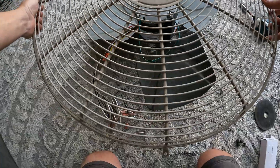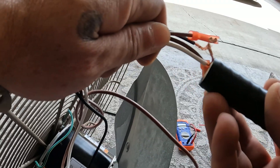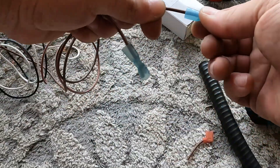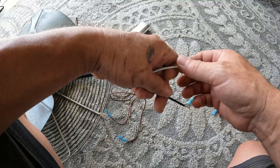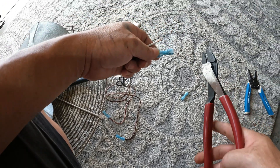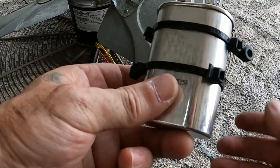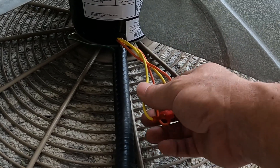Don't forget the ground wire. The 90-degree fittings barely fit down that tube. Now we've got black and white - it's line one and line two, and it doesn't matter which way you hook it up because it's AC voltage. I'll put these ends on there so it easily goes onto the contactor. Directional wires - counterclockwise or clockwise - we're just going to risk it and go with whatever it has right now, and if it's the wrong way we can just easily switch it.